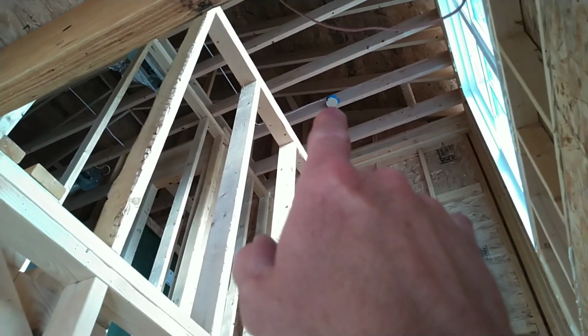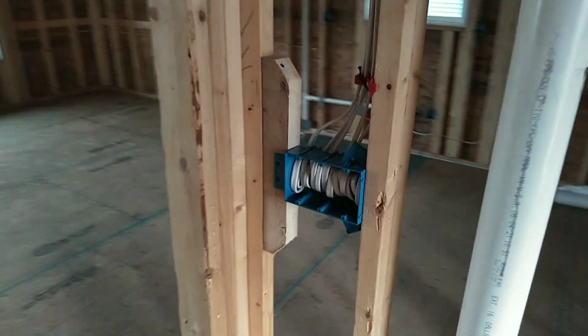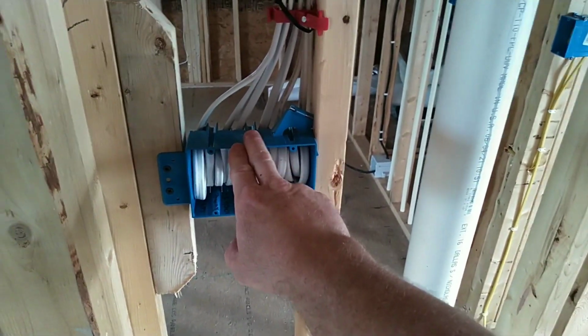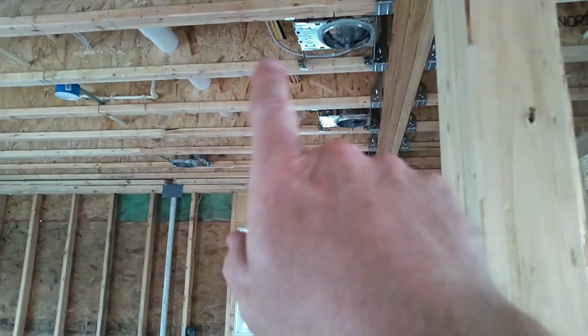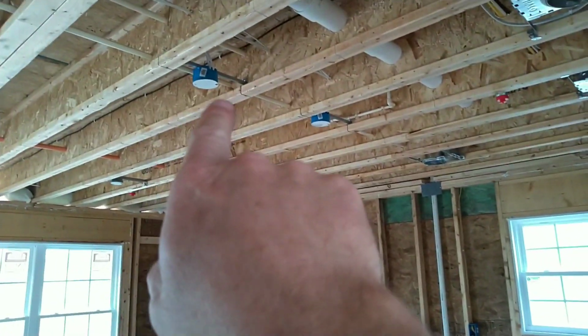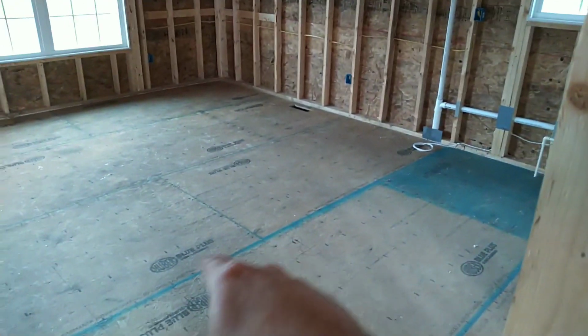We usually do a hanging pendant. Coming into here, you can turn your foyer light off right here, and this is another three-way for the kitchen cans. We have 4 cans in this kitchen. You can see them right there, kind of doing an L shape. And then this switch right here is for your 2 pendant lights that land over the island that I marked